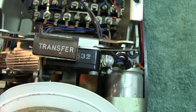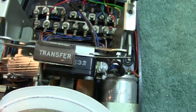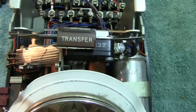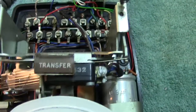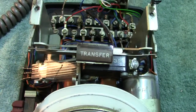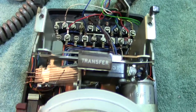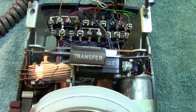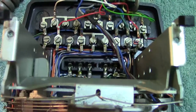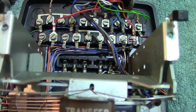This phone has a button called a transfer. It possibly enabled a call to be moved to another phone within the office. Because these would have been used mainly for internal work and private wires — hence it has got a regulator. The ones made for radio rentals appear to not have the regulator; that part was virtually shorted out. They didn't need it. But this one has got the regulator.